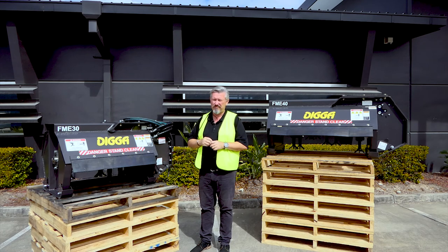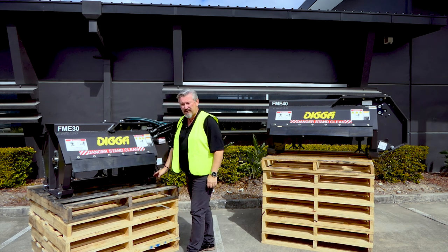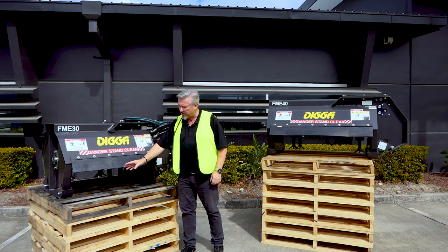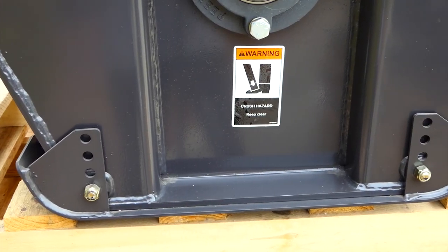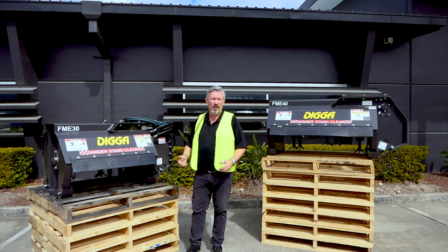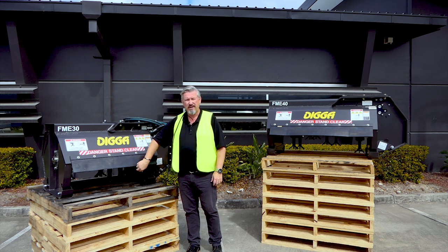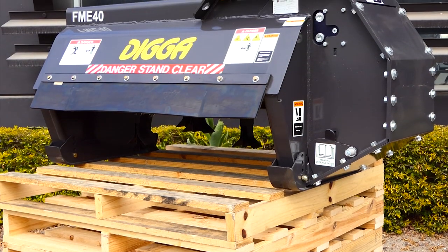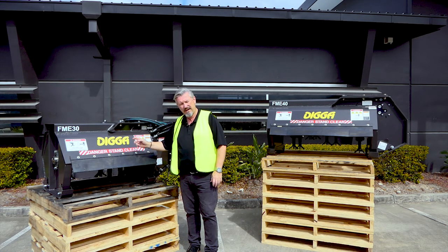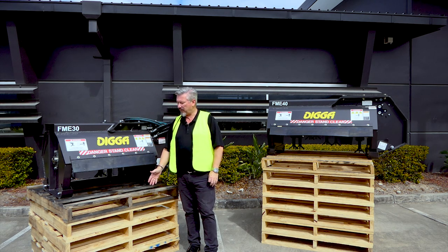You can reach over with that excavator arm and slash right down to ground level. It has skids — not rollers across the mouth, which would inhibit material passing through the centre to be cut. It has skids on either side with about four or five adjustments to allow you to get almost down to ground level for a slasher-type finish. All material is deflected down through heavy duty rubber flaps. The tooth design also chops material up very fine and deposits it down quickly to the ground.